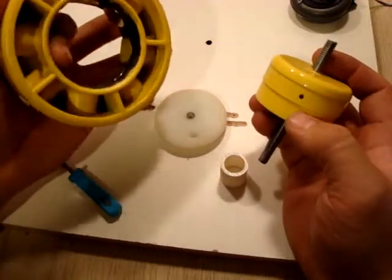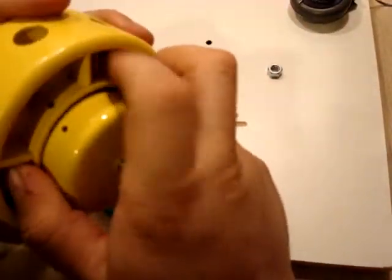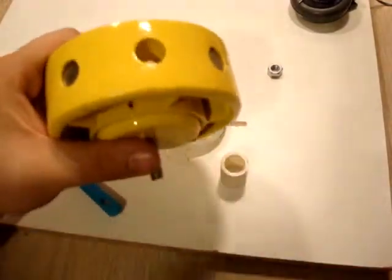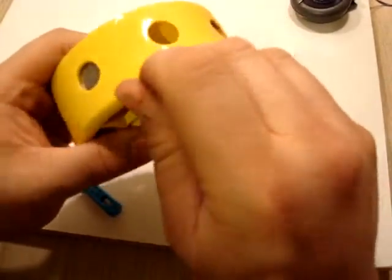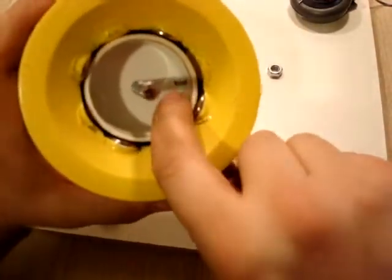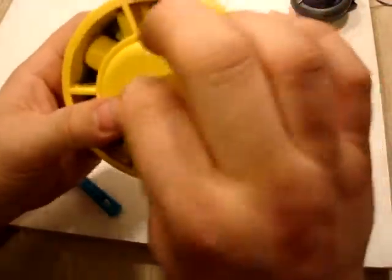This cut right here is centered so that it fits inside of our shaft here. So I'm going to take this and I'm going to be very careful when I set this in place. And then we have our centering hole that's here, and all I did for that was I just sized it to a drill bit. And so I will set this so that the drill bit will slide right in, just like that. And you can see how it comes through on this side. Okay, so that's going to support and center our center point here so that everything is centered.